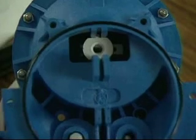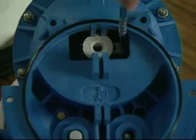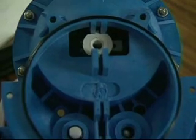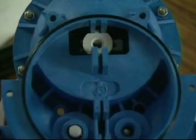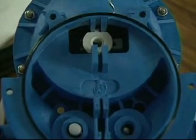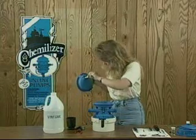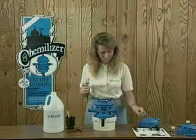The inlet valve of the lower section is identified by a molded minus sign on the bottom of the center section and a pointed valve. You will also see the piston stem retainer clip and a Phillips head screw that holds the center halves together. There is also a large O-ring seal. In the lower section, you can make two repairs: you can remove crystallization or chemical buildup from the bottom cap and outlets, and you can replace the piston stem retainer clip.